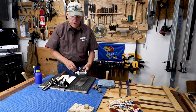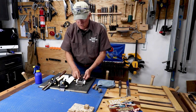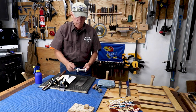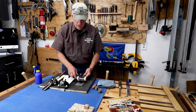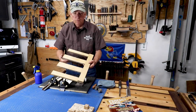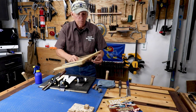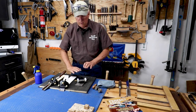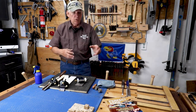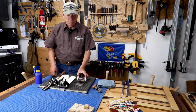Here's my one complaint: if I get a blade wider than a certain size, the rollers won't fit on my stone and I find myself running off the edge, even with my Wood River number seven blade. I solved that by building a cradle for the stones, which levels things out so I can run the rollers on it. But I don't like that because then I can't put my chisel sideways — I have to stop, take the stones out of the cradle, and then do my additional sharpening. That's a disadvantage.